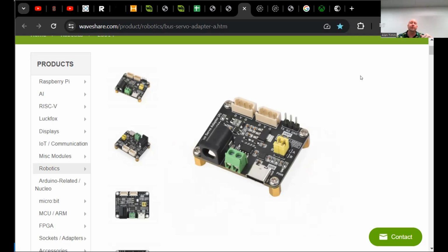Yeah, so all of those go into a power distribution board that I am both proud of and afraid to show you guys. That distribution board is fed by a buck converter. And then the buck converter has, it's probably a 5 amp fuse in line with the battery. So direct battery protection in case things get weird. And that's 5 amps at 38 volts. Then there are 2 other fuses that are run all the way up into the head with the switches, because you want to be able to access them. So I have a separate fuse block protecting the electronics rail and a separate fuse block protecting the drive rail. I just ran lines up through the body into the head to make it easier to get to in case things get weird. But yeah, power, when you're working with things like this, is very important to think about. Just because you can plug something in doesn't mean you should. Put a little bit of thought into it.